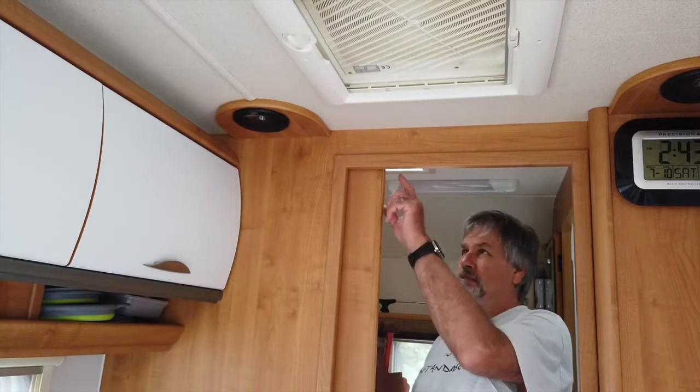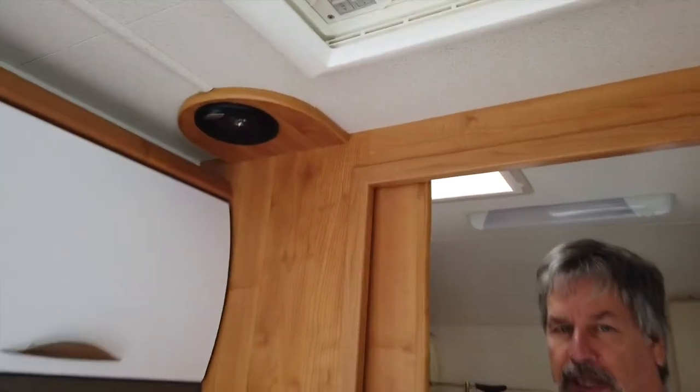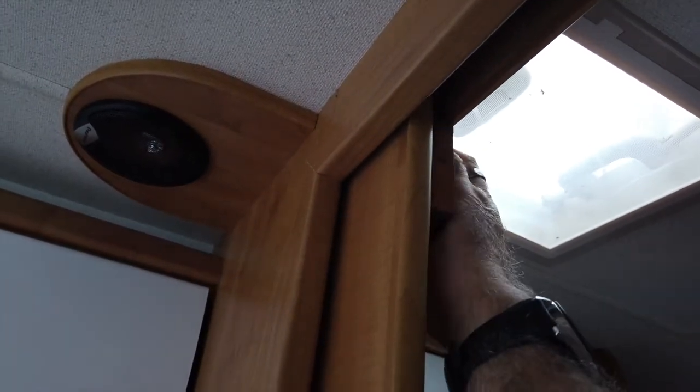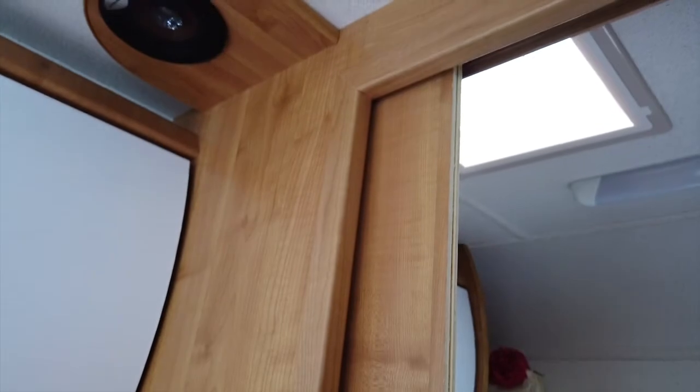Okay, so what I'm going to do is on the edge of this door, if you can come up closer to me, steady cam, there's this plastic edging. And if you get a suitable bit of timber and a hammer and then get around the edge and give it a whack, basically you can pull that off. So you see that's like a T-piece. Can you see that? And that's in the groove in the edge of the plywood.